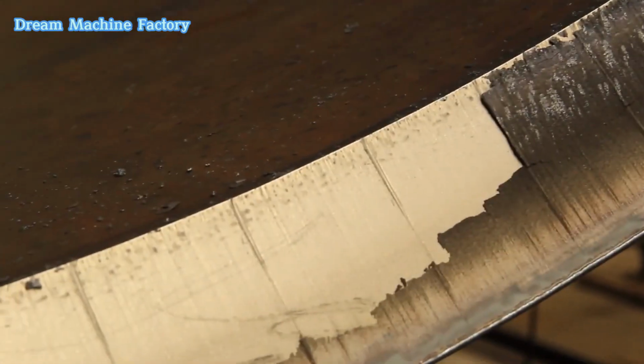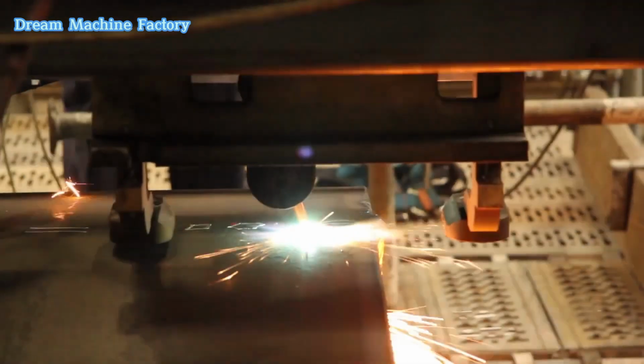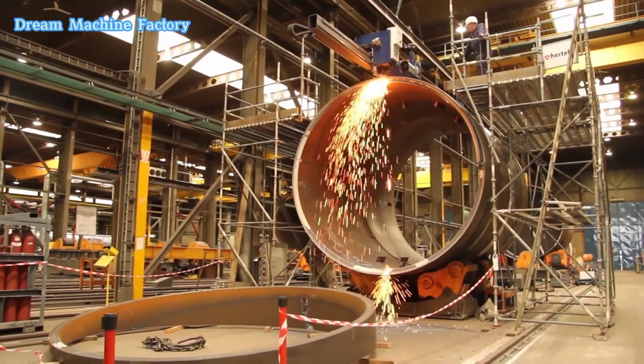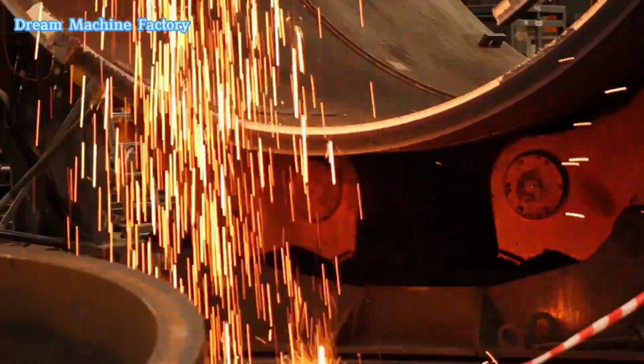It includes verifying safety measures, such as ensuring the machine's emergency stops and safety shields are functional. The final check also involves confirming that the correct tools are installed, the material is securely clamped, and the cutting path is clear of any obstructions.